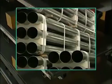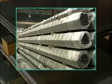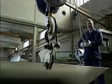For instance, wood, hardboard, polythene, even old carpets can be used to prevent stainless steel rubbing on carbon steel machinery and equipment such as this storage rack. Storing on the floor is never a good idea, and neither is using a pile of sheets as a temporary workbench.